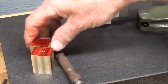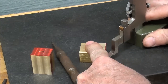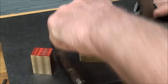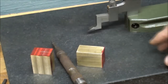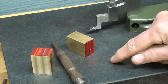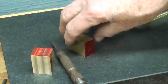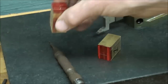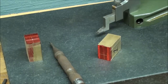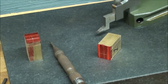Both of these are exactly the same height now, and I'm laying them out three-eighths by three-eighths. Can you see how there are tiny shavings produced by this carbide scriber? Then I'm center punching both of them right on the target, and we're ready to go over to the Logan lathe where we're going to drill and ream them half inch — five hundred thousandths.